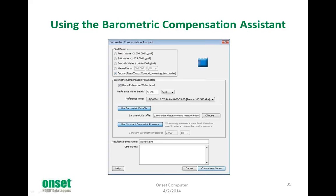If no barometric data is available, to what extent will the results be affected? You can see six inches of variation pretty easily from barometric pressure changes. If you're just deploying over a short period of time, like over a day, you're not going to see dramatic barometric changes in most cases — if you're doing a pump-down test, you probably don't need a barometric pressure data file. But if you're deploying over a length of time, you really want to have barometric pressure data. I know NOAA and there are sites where you can get data from nearby weather stations including barometric pressure data — you can import that to correct for barometric pressure changes during your deployment. Sometimes you might have to pay a nominal charge, but at least that data is available.